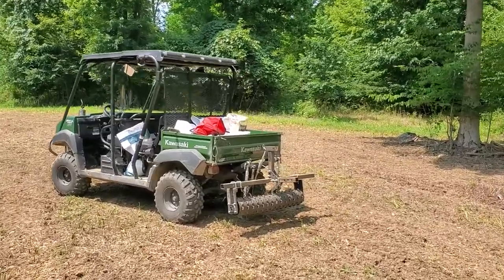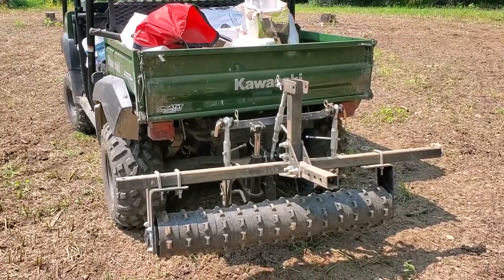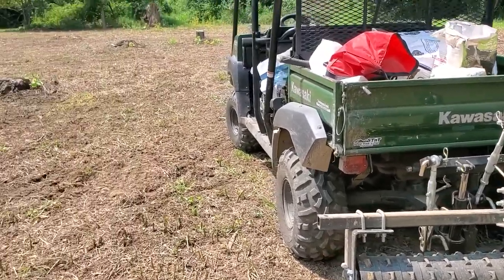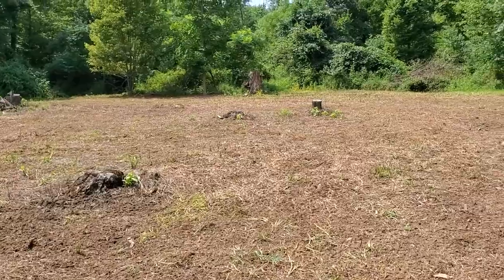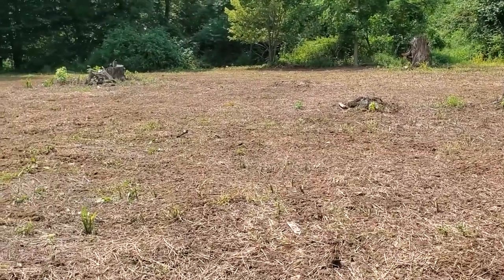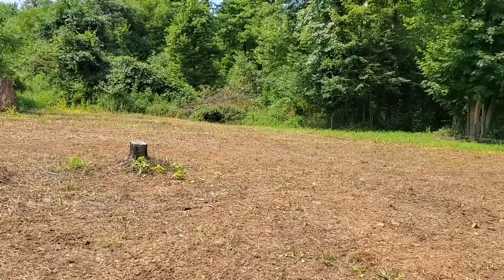Here's a cultipacker on the back — I just finished up. As you can see, the disc just slides off and then you can put whatever attachment you have and slide it on that bar. It did a very nice job. It's not perfect, it's not like a farm field, but it's going to work just fine. You can see the thatch was worked up a little bit and spread out some — much better seed-to-soil contact. I can still see some of my larger seeds on the ground, but the rain will come in and it'll get a good germination. That's how it looks right now.